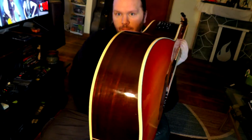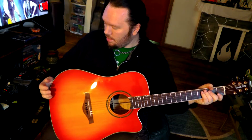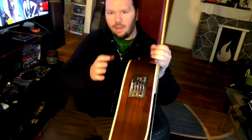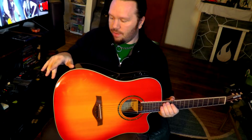The most interesting thing to me is this cutaway — just like your Fenders or electric guitars would have, that arm bevel. There's a bevel there, so it is actually more comfortable to play than your standard acoustic; you don't have that extra inch of body pushing into your arm. It's a compound curve all the way around, and despite where this guitar may have been made, there's some very complex engineering to make a curve like that. If you do a miter joint one direction and a miter joint the other, that's difficult enough, but to do a complex curve the entire way takes real forethought. Spruce top, mahogany back and sides — it's just a really fun guitar.